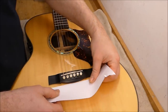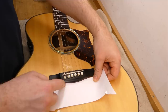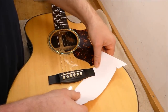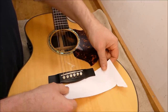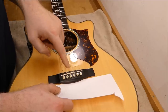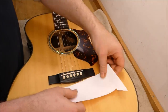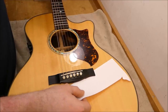A piece of paper and we'll see what's going on — and yes, it is loose. That's kind of fun, this little detail where it recurves at the end of the belly. How far does it go? Actually, that's a lot more than I was led to believe — this whole treble side is loose. Sometimes on upper-end guitars, if I know they were made correctly, I can get away with just sanding out the old glue with some fine sandpaper and clamping it closed. But in this case so much of it's detached that I'm going to have to take this off and make sure there's proper contact, then re-glue the whole thing.